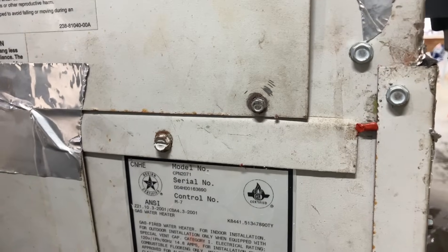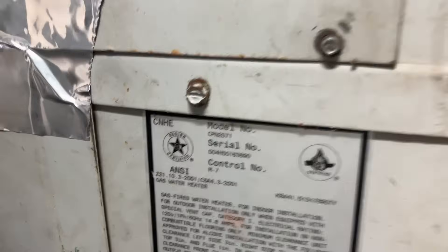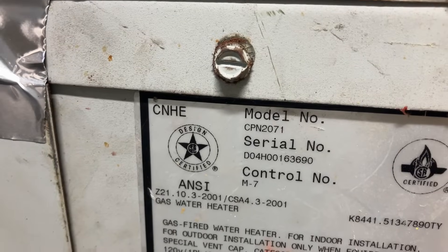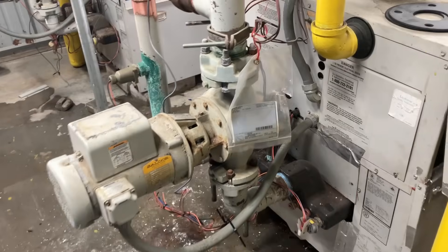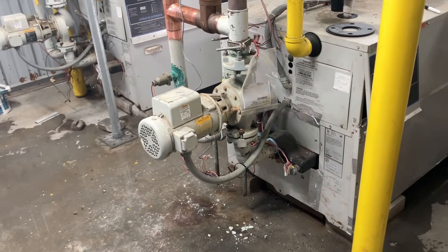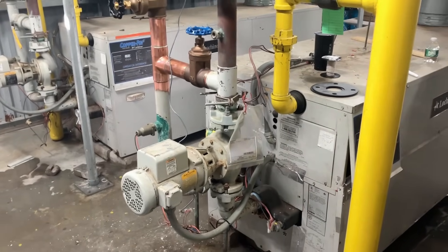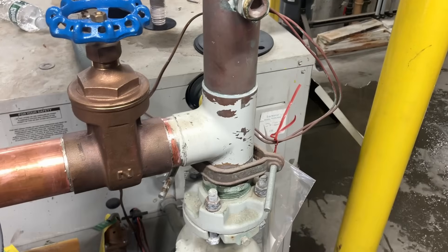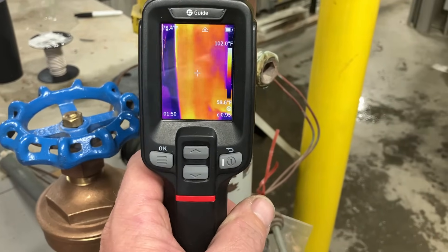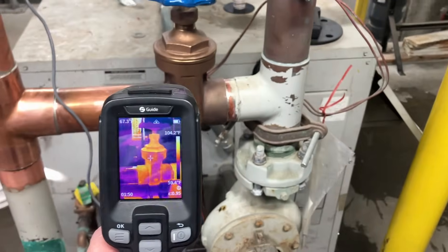Lochinvar CPN 20 and 71 — we're on. Now we just need to measure for a temperature differential. I'm going to get my thermal camera. We don't have temperature sensors on anything here, so we're using a thermal camera. We have 79 degrees inlet temperature, my bypass valve is fully open, and my outlet temperature is 106-105 degrees. This needs to be like 140-160 degrees — we're only at 106.